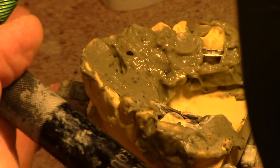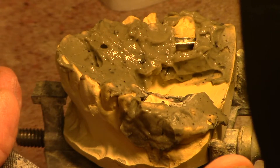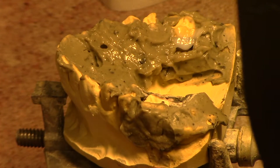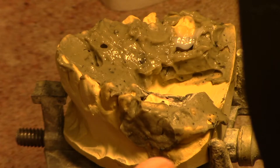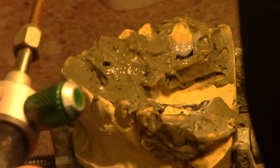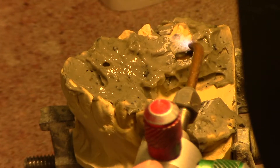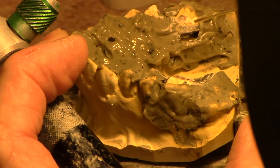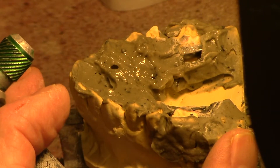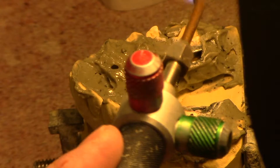I'll show you what happens if I just put the flux on without heating it up beforehand. There's discussion about how much flux to put on — if you put on too much it could cause it to bubble, but really contaminants and overheating the solder are the two biggest reasons for bubbling. If I'm going to err on flux, I'm going to err on the side of too much. You can see the flux has melted up here but there's no flux down in this area — that's what happens if you don't heat the wire before applying flux. I always like to run a little heat on there first so the flux sizzles and runs everywhere.